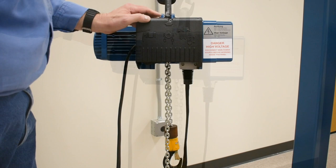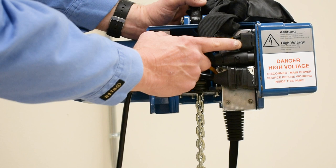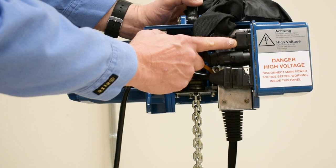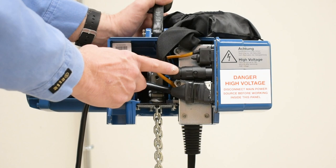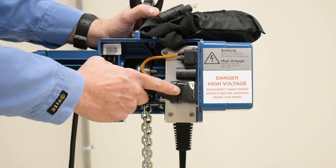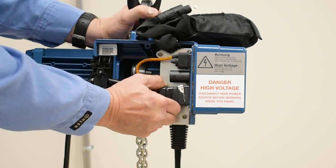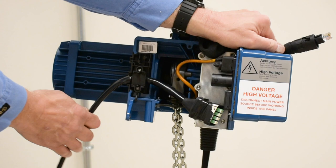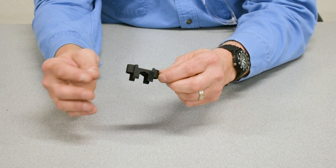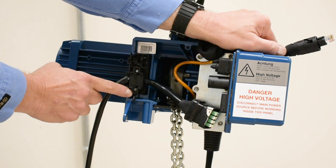Next, we'll remove the single screw at the top of the black pin. Then we'll remove the pin. Below the square grommet plug, which houses the trolley dummy plug or trolley connection if a trolley is provided, and the limit switch for the hoist, the center twist lock plug is the pendant connection. The lowest plug is where the three-phase power and ground plug in. The cable feeding power to the hoist has a clamp that is notched on one side for round cable and has a geometric flat pattern on the other side for clamping flat cable. In this case, we're bringing a round cable to the hoist — remember to turn this clamp to the proper orientation.